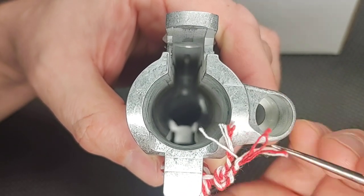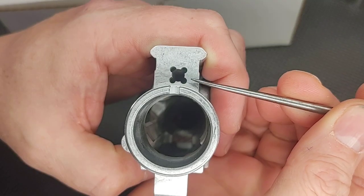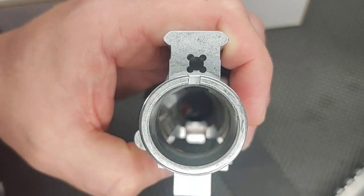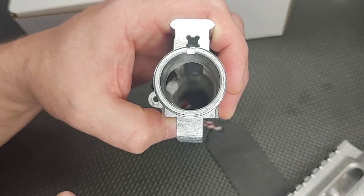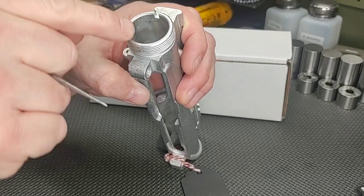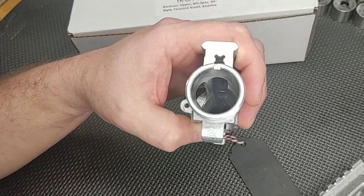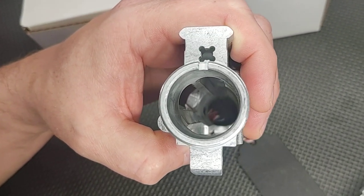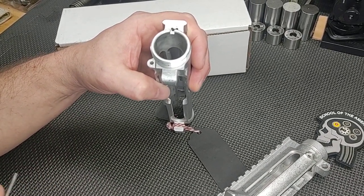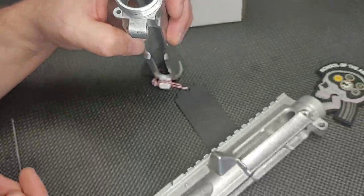It's pretty hard to detect with the naked eye, but here's where it really stands out — look at the gas tube hole. Look how off-center it is: thinner here than it is over here. This upper receiver will still allow the gun to work, but because the bolt carrier and everything isn't timed or clocked properly, the barrel that goes in will need more gas than one going into a properly built upper. So all things being equal, if a properly built upper cycles with a certain gas port size, this one might not cycle until you open the gas port up further, because things are misaligned.